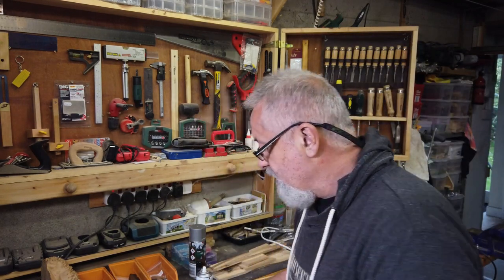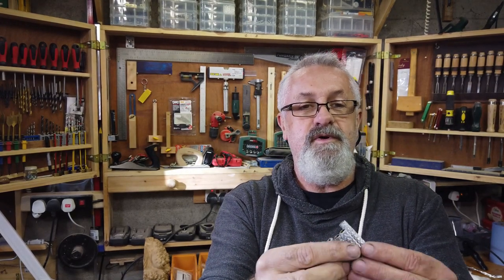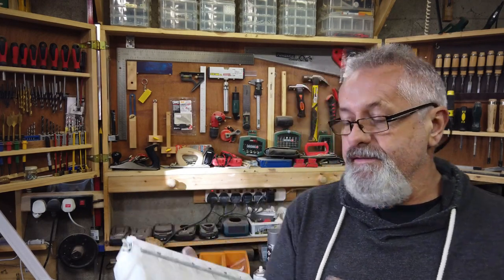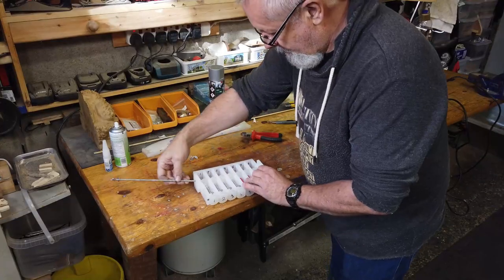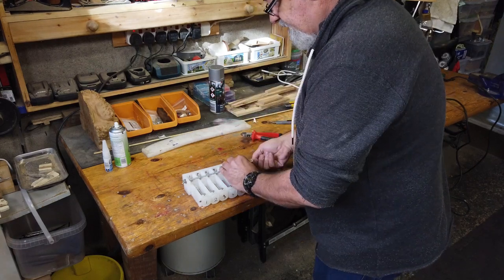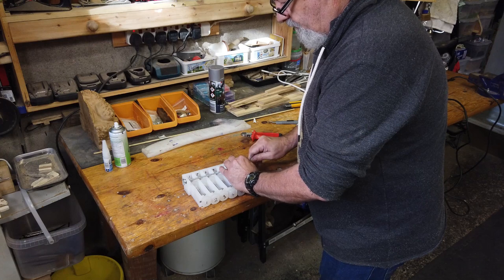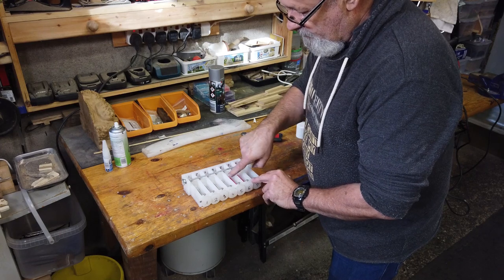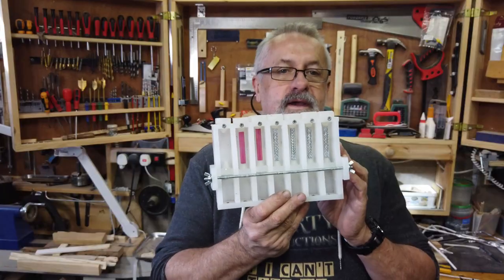I am going to do the other four but I will just speed up through the process. It went a bit quicker than what I expected — practice makes perfect. Now the next step is to load them into my in-tube mold for casting. Add my tensioner — this tensioner is in line with the end holders, and that prevents the resin from seeping to the back.